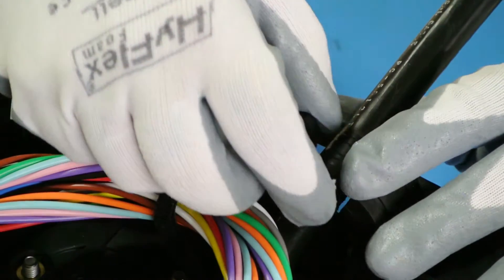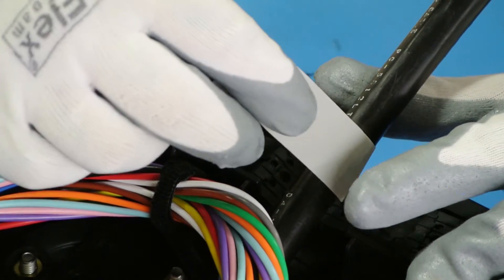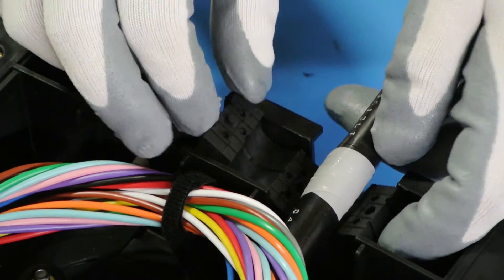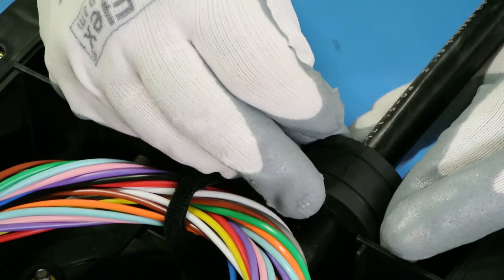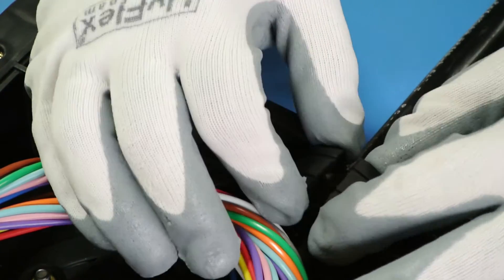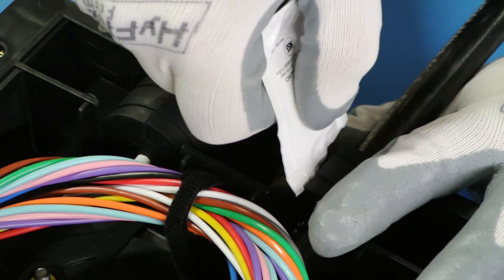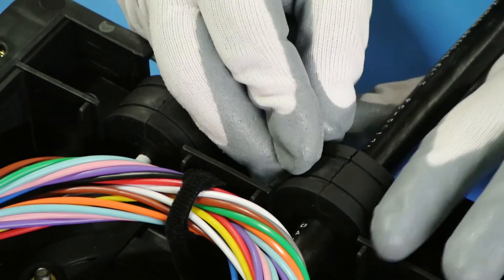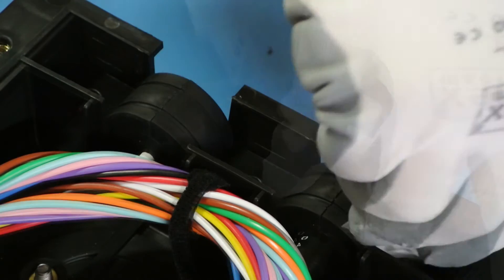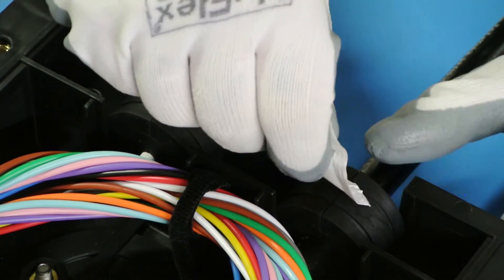Applying mastic tape around the cable will ensure a tighter seal. Before closing, apply the silicone sealant packet to all the appropriate places. Apply around the entire grommet and across all areas to be sealed.